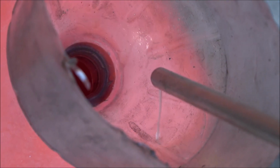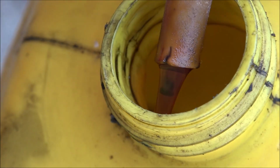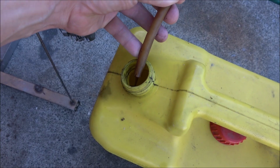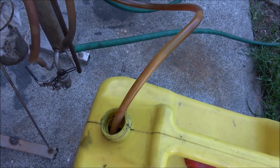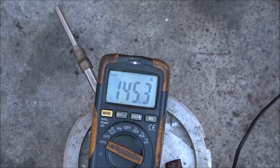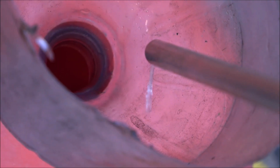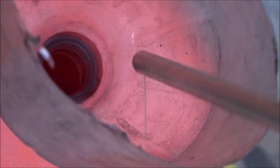Now we have separation of petrol and separation of diesel. We're still gaining temperature. I plan to run the distillation at approximately 170-175 degrees Celsius. This diesel fraction will get darker because it's still pushing out the clean fraction that's been sitting in this still for a while because it's constantly primed. I never drain it. Still gaining temperature. So my goal is to separate the petrol fraction first, and I would deal with diesel later.